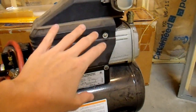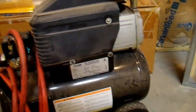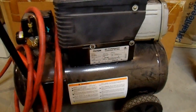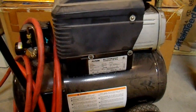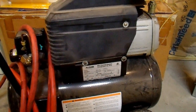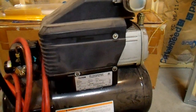The CFM of this particular compressor is four or five — it doesn't really matter. You'll never be able to get the CFM you need to clean out a line on a 110 or even a 220-volt appliance. You need one of those diesel tow-behind units used for construction purposes. I don't have one of those, and you don't need one. This just takes a lot more time. The high CFM 50 to 100 CFM diesel air compressors will clean out your line in five minutes or so. This will take me a few hours — that's the trade-off. But it's free, I already have it.